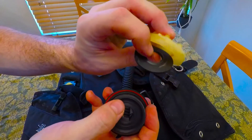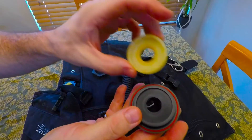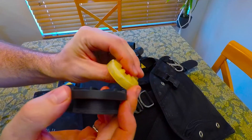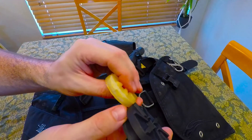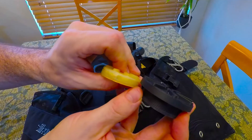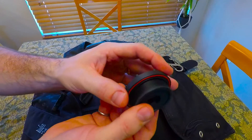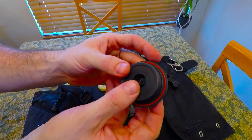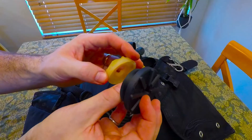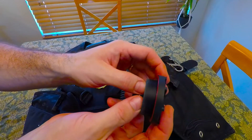The gasket that provides a seal fits right in on my new one just like it did on the old one. You can't see the old plastic piece because it cracked off and is still in there — I haven't cleaned it out yet — but I've made it much, much thicker, so you're not going to break this one or have it fail on its own. Also, this is UV-stabilized ABS reinforced with carbon fiber. So not only is it thicker and more durable, I also used the right material for the job.